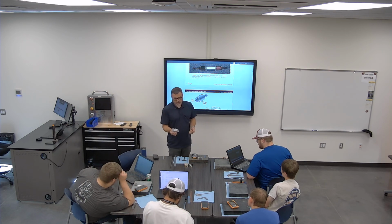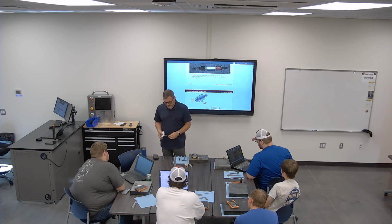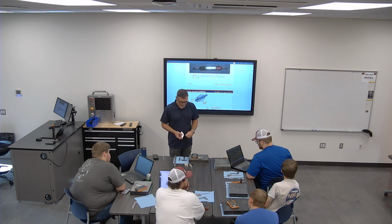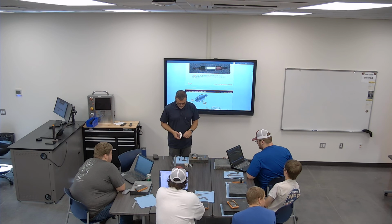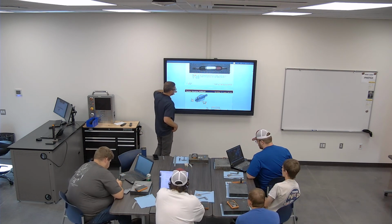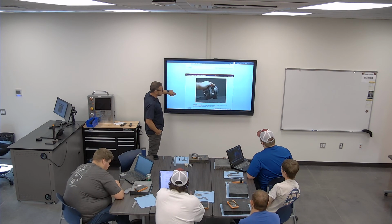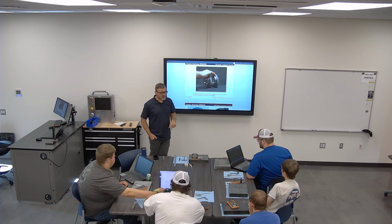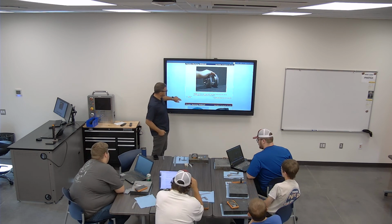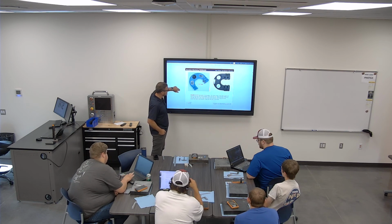Here's a block that I'm hoping we can have some time to measure today. This is a 3/8-16 UNC, 2B is the class of fit. So here's the go side, and the no-go side is just identified by that red band. Just take that and pass it around. Here would be one for a taper, same thing as an MPT gauge, it has a taper on there. Here are some ring gauges. You'll use ring gauges, especially when you get to calibration on the CNC for the probes. Here are some special gauges that go around the outside of a shaft.